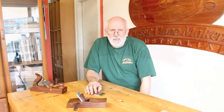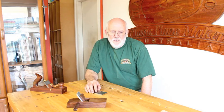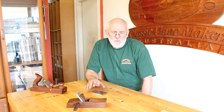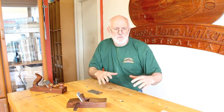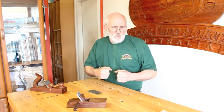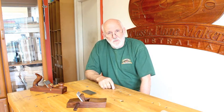To round off this video, I'd just like to talk a little bit about my experience as a woodworker. When I started woodworking, I had a number 4 Bailey pattern plane, and it wasn't really until I did a large flat surface, making a dining room table, that I realised the limitations of this plane. The plane kept tearing because I joined several pieces of wood together. The grain direction wasn't all one way, so I'd get tear out, and I'd have to force the cut, which I found quite difficult. In the end, I didn't understand all the factors involved, but I went out and bought a belt sander, which I now regret, to finish that tabletop.